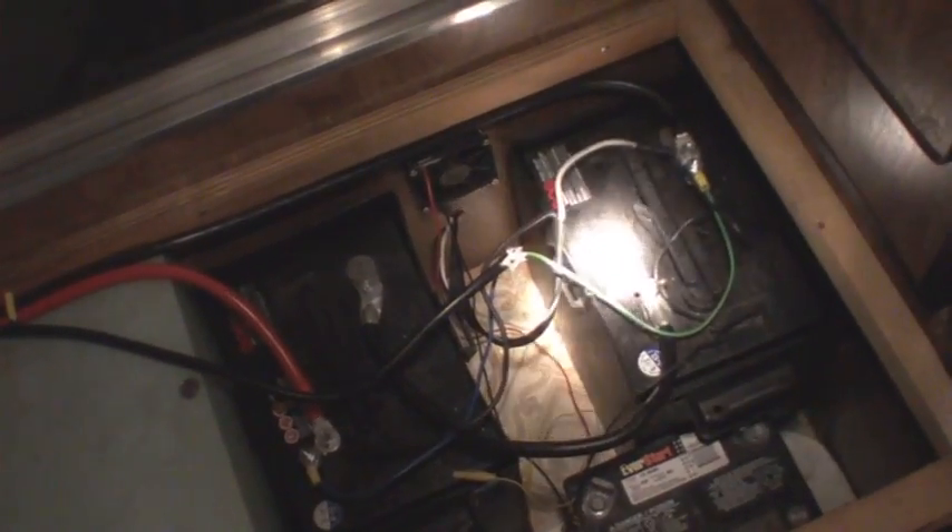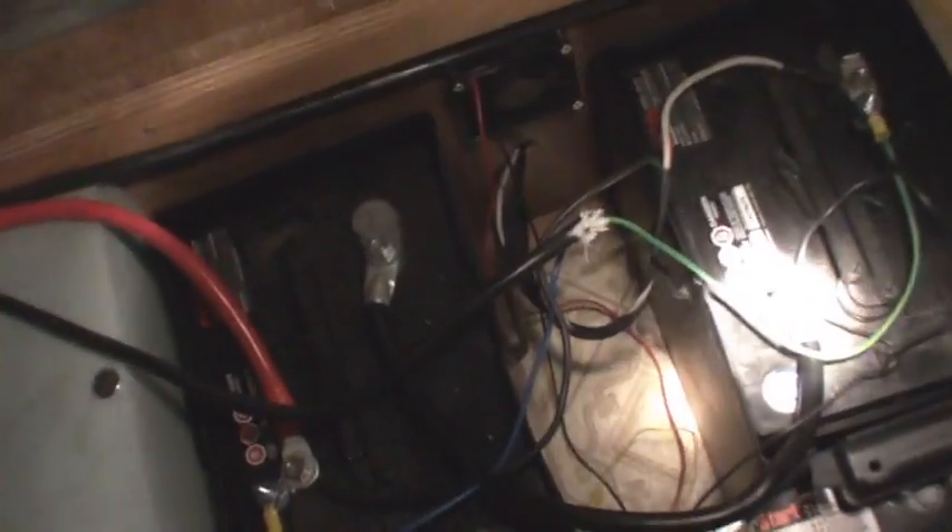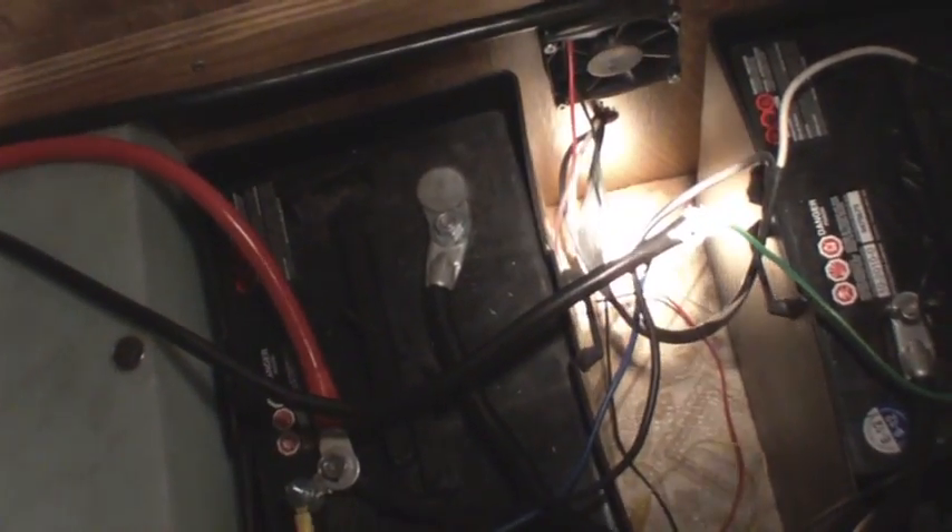That white line you see over there in front of the light comes in down at the bottom of the wall, and that is going to my alternator which is running off a relay. I have a diesel motor in this truck, so I've got two batteries up front. When you kick over the ignition, she's charging these in the back. So every time you drive the vehicle it's charging. You want to run 10 gauge minimum - that's 10 gauge wire.